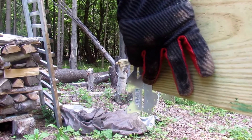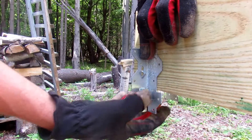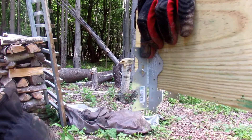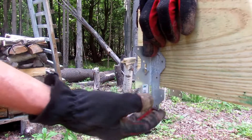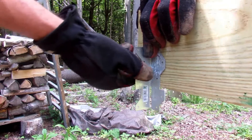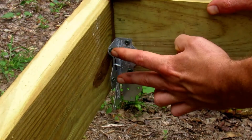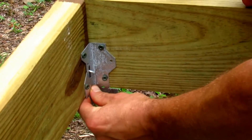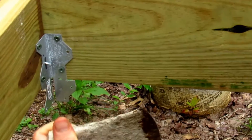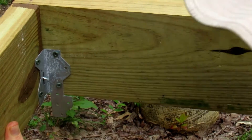Remove the board, hold it in place. You might need an assistant here. Come through with a screw gun and anchor two in. Once you have your end joist anchored in with those two screws, before bending your board to meet your other bracket, go through with a hammer — or in this case an axe — and bend these under.